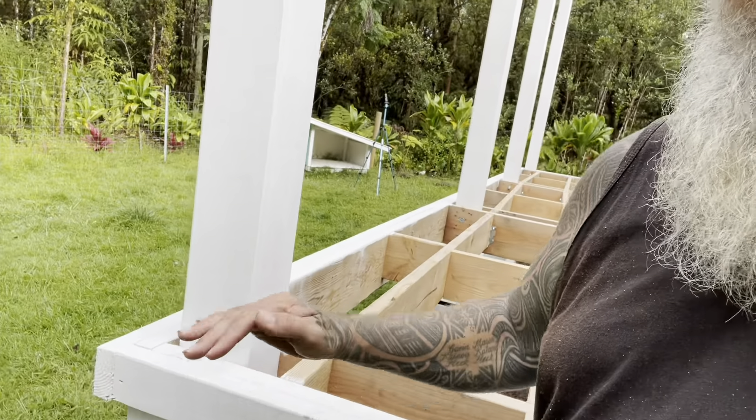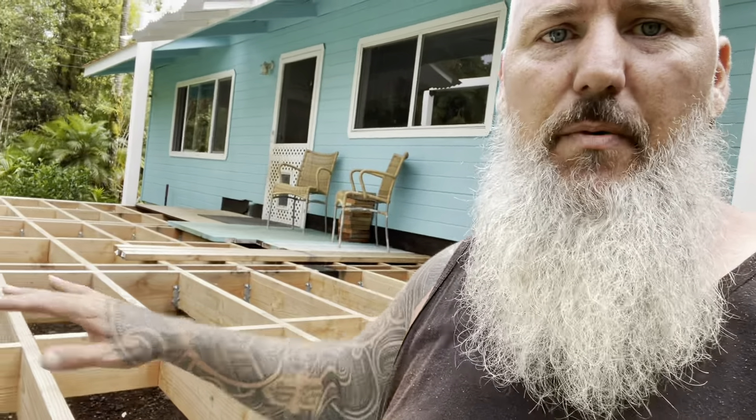Today is Saturday, so the Trex will be delivered this week. Most likely on the next video we'll be starting on the Trex. I have to get the 16-foot 6x6s painted and installed, and build a new set of stairs at the right spacing to accept the Trex — the stairs will actually be Trex too, the straight boards with no grooves. I have the butyl tape and it's going to go on top of all the joists.